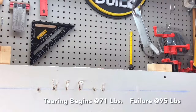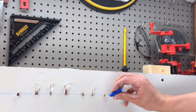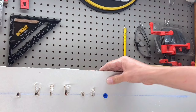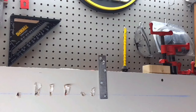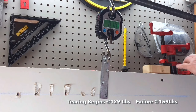The next anchor is a different style and shape. The blue anchors, also called plast plugs, have a unique design. To insert the anchor, you squeeze them flat and push in until the outside is flush. This anchor by far broke the most out of all the ones I tried — while inserting it, if the hole wasn't quite right, the wings would snap off or bend completely out of the way. Once it goes nicely into the hole and the screw is tightening, it will pull back the tip, causing the wings to open inside the wall. Similar to the second anchor, these leave quite large holes in the wall even if removed properly. These blue anchors are rated at 80 pounds. They did exceptionally better by not tearing until around 129 pounds, and actually didn't break free until double their rating at 159 pounds.